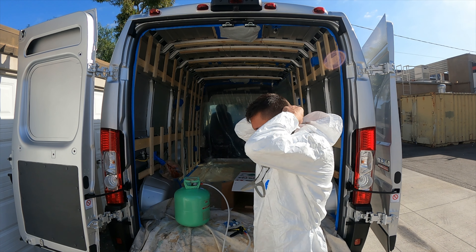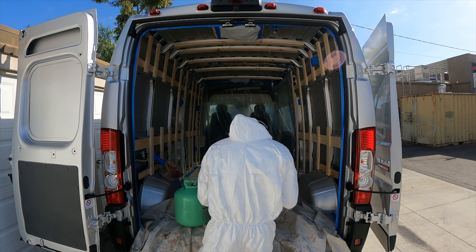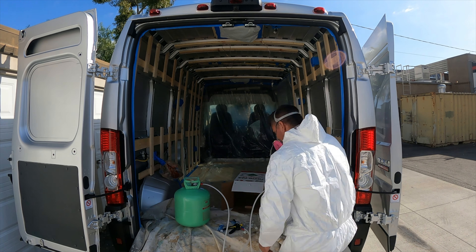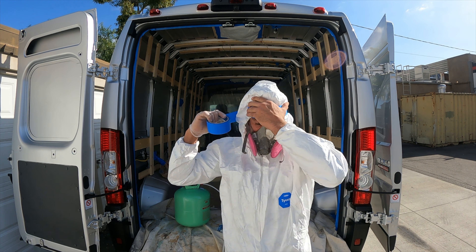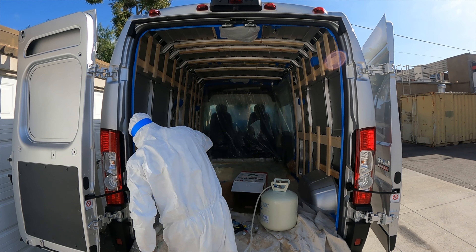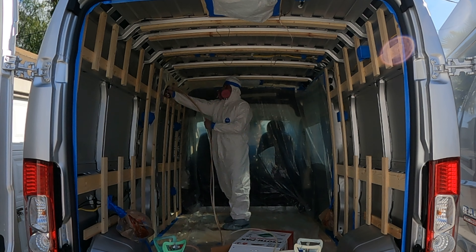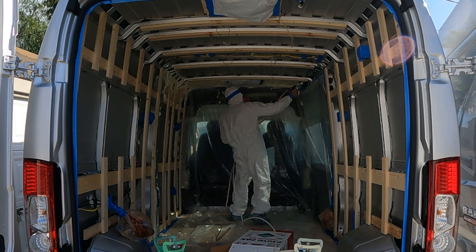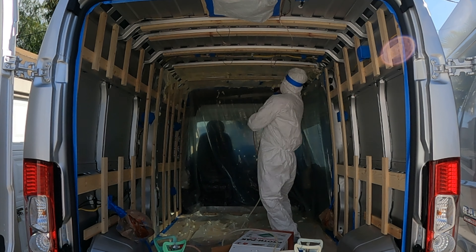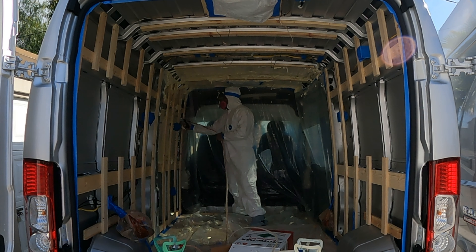The white ones are a cone spray. We've got four of the blue ones so we'll use those first. You're also going to need one of these protective suits and a mask — I'll put links for those as well. Now open the two tanks all the way, and the first few sprays you want to spray into a cardboard box just until everything's mixed up — the first little bit you spray out won't cure properly.